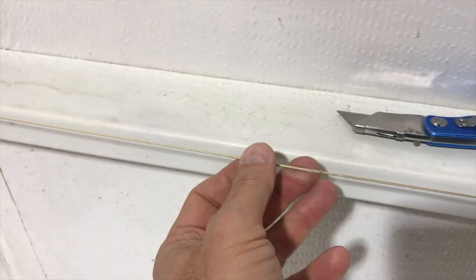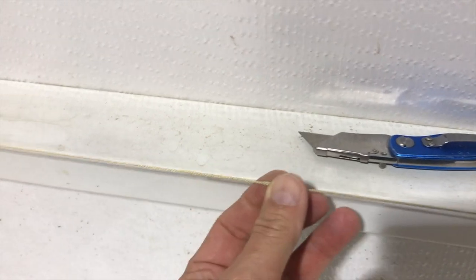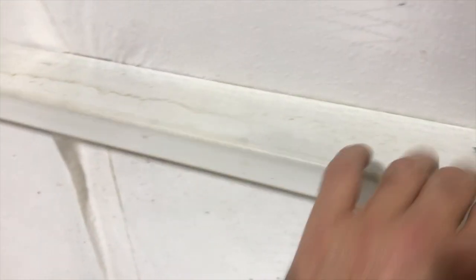Then I'll check it for length. The beauty of this is I shouldn't have to do a whole lot of adjustments to my wingtip steering lines because I honored the length of the original line. I could have just done it wild and made the adjustment at the brake handle, but that would probably take more time than the way I did it here. So here's the new line. Here's the new serving. Nice and tight, drag free, won't catch on anything. Midline length, and let's go kite the wing and see how close I came.